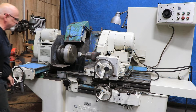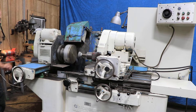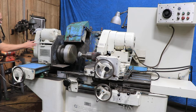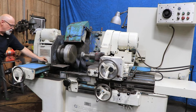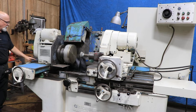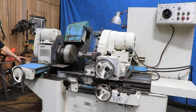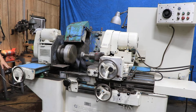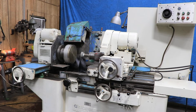It's mounted up here. Your headstock slide — this moves in and moves out. It has a lock, so if you want to lock it in position it doesn't move. It swivels; you need a little allen wrench underneath here, and you swivel this after you loosen the two screws. We've had all this off and cleaned all this up, so this all moves real nice. Over here you have your sine bar attachment and your multiple fixed stop option, which has all been gone through and reconditioned and cleaned up nicely.